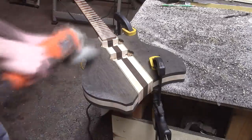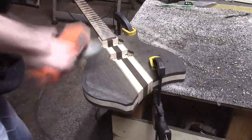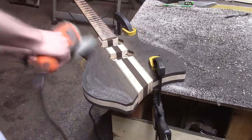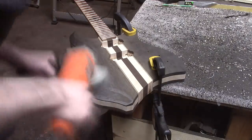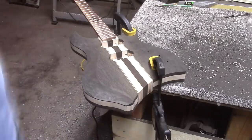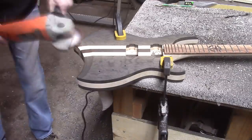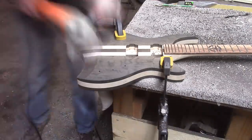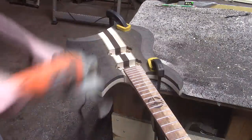And I find this to be a fairly interesting process, personally, so I show essentially the whole thing right here, obviously in very time-lapsed fashion. But just so you can see how I do it, it's not just one big hefty carve all the way across. It's a whole lot of small carves working away to where I want it to be. You can see there, I know exactly how deep I want it to be along the edge, and also how far up into the body I want it to go. So I've got lines marked out for both of those, so I go to those lines first and then work away material in the middle until the carve is what I want it to be.